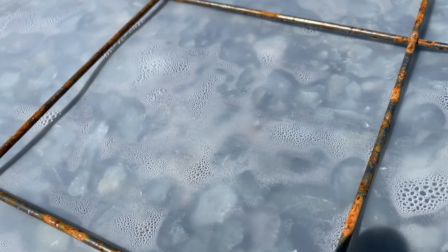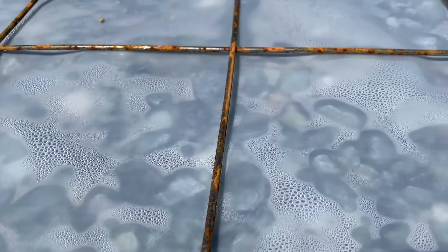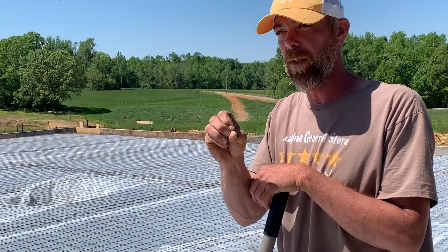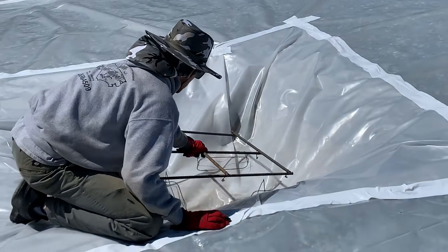Yeah, we definitely want to keep the moisture out. But even though this building is open, moisture can break concrete down over many, many years. I guess that's freeze-thaw cycle mostly. Well, I don't really know. I mean, we've been in mills and stuff and it's just hard to determine the rhyme or reason that the live floor might break down in a particular section. But if you go up and under it, usually the plastic is broke down or improper soil, but it's like rotten almost — the concrete itself. Wow. I guess there's no vapor barrier. Like you can almost peel it away with your fingers once you've started to bust it into pieces. You can just tell it's really, really broken down. So yeah, good reason to use the vapor barrier.